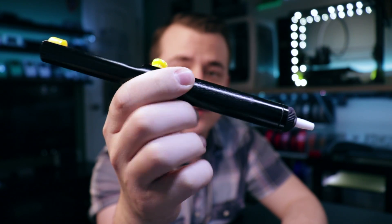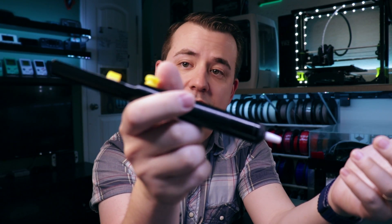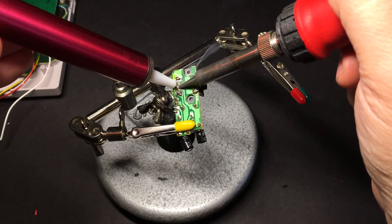That's it for the really big things I'd recommend getting right off the bat if you're getting into electronics. Now we'll go through a few other smaller things that are still really nice to have on hand. At some point you're going to need to remove solder from whatever you're working on — whether it's because you accidentally connected two things that you shouldn't have, dripped some solder while working, or you're removing components and just want to remove excess solder. That's where these come in. This is a solder sucker — you may have seen me use it in some previous videos. The way it works is you heat up the solder you're trying to remove, push the plunger in, put the tip next to the solder, and push the button. Pretty simple.